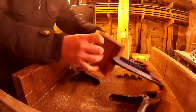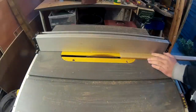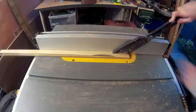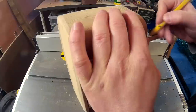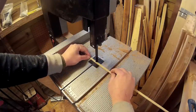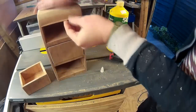I wanted to make trims for the top of each drawer to hold the drawer in snugly, and I decided to use the oak offcuts for this. I tilted my table saw blade to about 7 degrees and cut a thin strip. I marked up the length and then cut them on the bandsaw to size, and glued and clamped them with spring clamps.